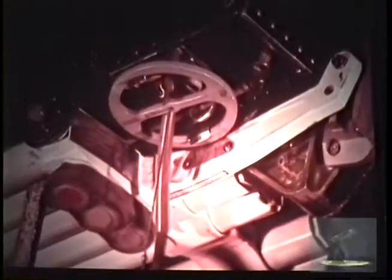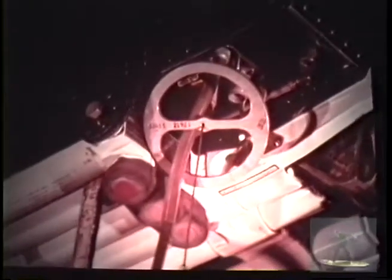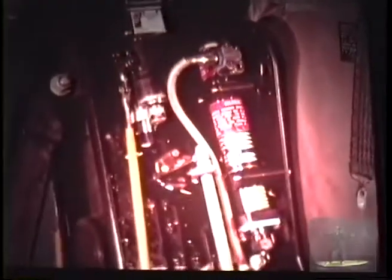The line to the gas-powered inertia reel is pulled from a quick disconnect coupling. The electrical connection to the seat actuator is broken. The lower block of the composite disconnect is pulled from the survival kit. A trip rod pulls the sear from the drogue gun and the escapement mechanism starts to run. Another trip rod pulls the sear from the time release mechanism, which assumes a ready condition. The IFF switch is tripped.